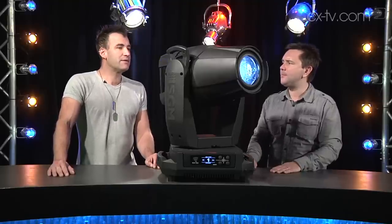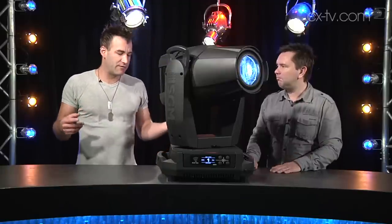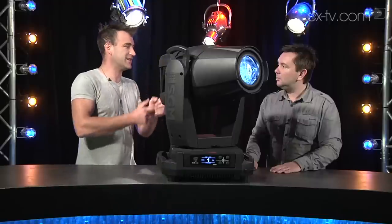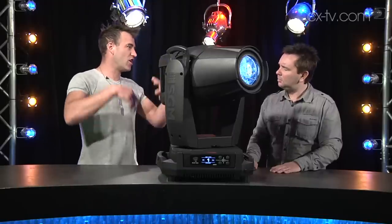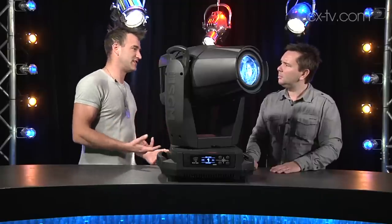Yeah, so why is that? What's going on inside? Okay, well, look, inside we've got an RGB Y light source rated to 50,000 hours, 17,000 lumen output. We've got an 8 to 43 degree zoom with a quasi 1 degree effect. We've got dual 5 position plus open rotating indexable gobo wheels. We've got a 4 facet rotating prism. We've got strobe. We've got full color mixing, obviously. We've got 540 degree pan and 270 degree tilt.